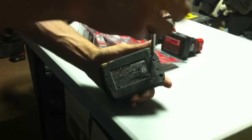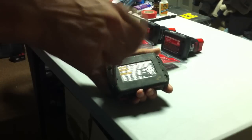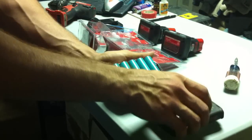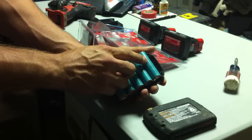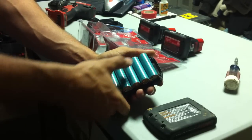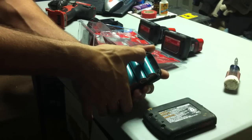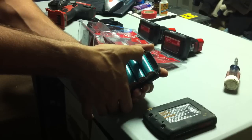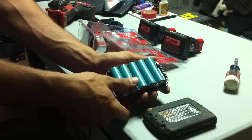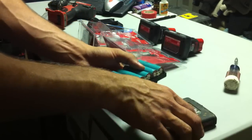I'm gonna open this pack up real quick just to show you the inside of it, since I've already had it apart tonight. I'll pull the cover off and you can see right here it has INR 18650 cells — they're the 13Q version. Having an N in the part number means this would be a lithium manganese or maybe a lithium nickel battery. I'm not positive.